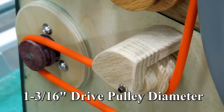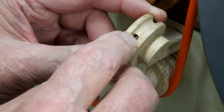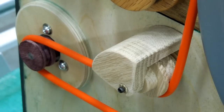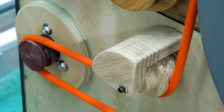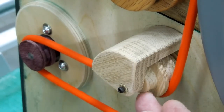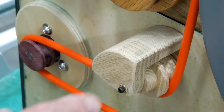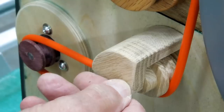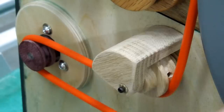This pulley is oak. I made two of these at the same time in case I broke one. Both were drilled and tapped for a set screw to be a motor pulley. Later I made the motor pulley one inch. I took this one and added another hub so it would space out to act as an idler, running on a 5/16ths dowel. I'll put a lot of paraffin on that dowel to lubricate it — that should last a long time. I have a 4-40 bolt threaded in here just so I have something to grab with pliers to pull it out if needed. That dowel is in there quite tight and I do not expect it to turn with the pulley.